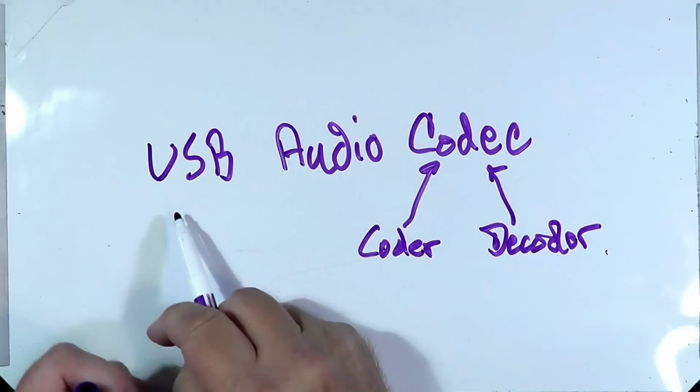So this is what you will see. Now, different manufacturers may come up a little bit differently, but this is the one you want to find. It'll often have a number, maybe in parentheses or something, but this is what you want to point your digital software at so that it gets the right sound card. The biggest single problem with getting digital to work is getting it to recognize the correct sound card. The next biggest problem is getting it set up for push to talk.